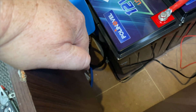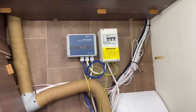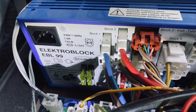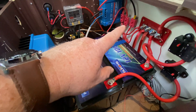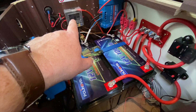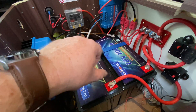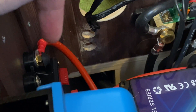A cable goes to the back of the van where there's an automatic switchover which gives priority to hook-up, or if there's no hook-up the inverter comes on and powers the van. The van's existing electro block 12 volt system powers things like water pumps, the lights, the fridge and similar. My system here is a standalone system connecting back to the original one. If I want to disconnect either battery I can just trip it; on the B2B side I can trip it down there to stop B2B charging as well.